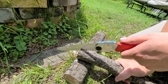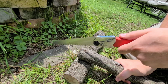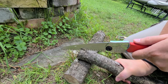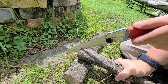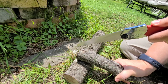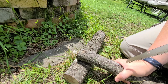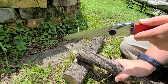You can't really see this, but it's almost like a chest pull grip. I've got my elbow here. My elbow's hitting myself in the gut. So when I pull back with this saw, this is all the further I can go. So I'm really short stroking it because my elbow's hitting my stomach. So I've got a stop point built in there on purpose, so that I can't come, see, like I popped out there on purpose. I can come out and I can still catch the saw here. I'm not using the tip of the saw where I could slip out and hit myself. I'm more here, and if I jump out, I can't hit myself.